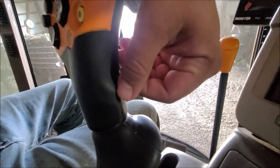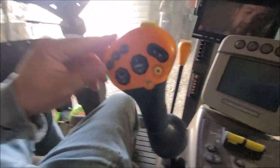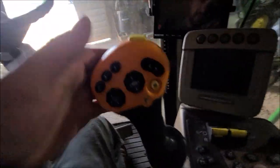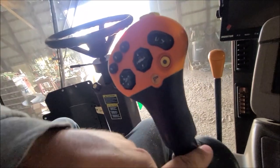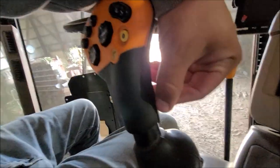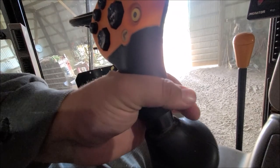What we're dealing with on this 9770 is a crack that was all bubbled up and starting to peel. What I did is I used industrial strength Gorilla Glue Gel — essentially super glue on steroids. I peeled all the rubber back, filled it full of that glue, laid everything down over top, squeezed out all the excess, and wiped it off the best I could. A couple days of running it will wear down any residue.